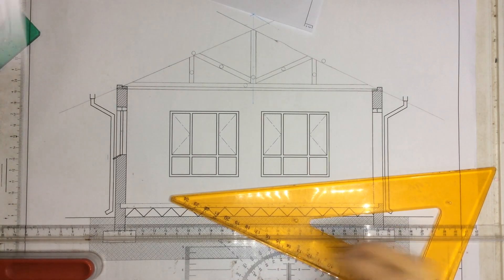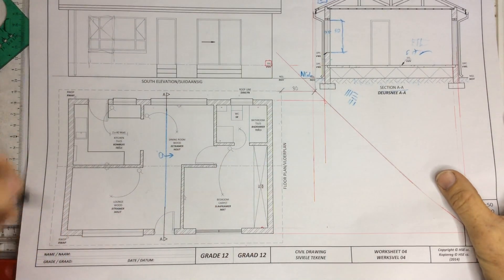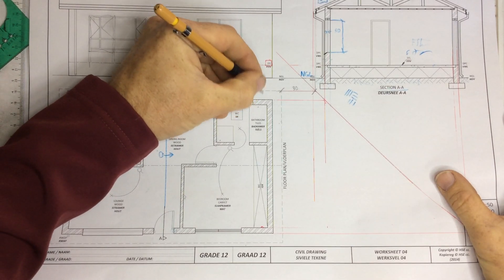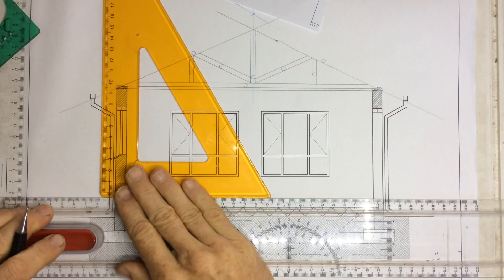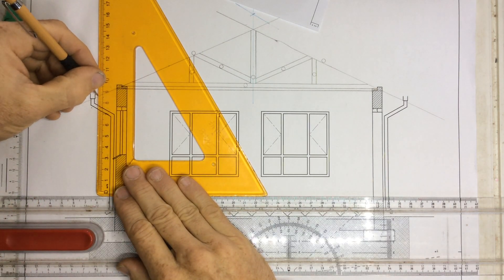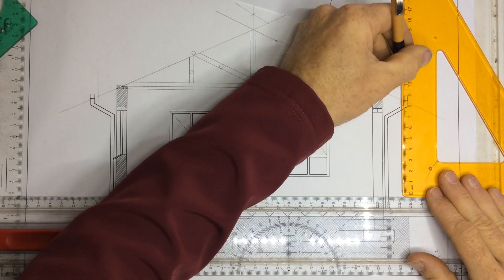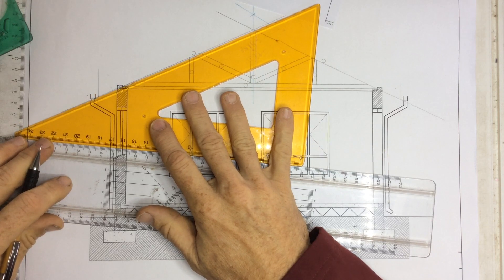You'll have a plan view showing this dotted line going around. The distance from the outside wall to there will give me the distance of the overhang of the roof. So I'd measure that off so I know exactly where to stop — it's going to be somewhere over here. I'll draw a little construction line there, measure it off on this side, and draw a little construction line going up, so I can now draw in my roof truss.